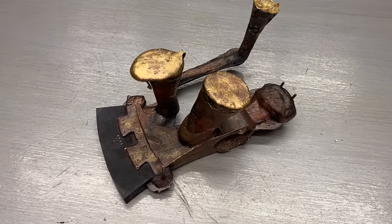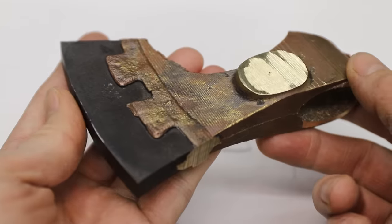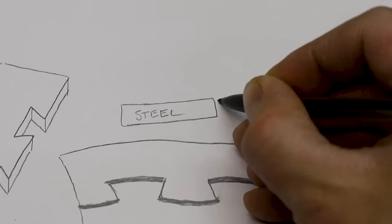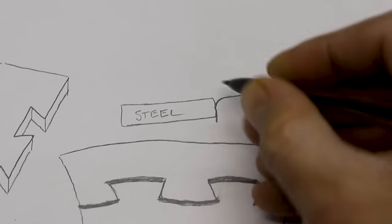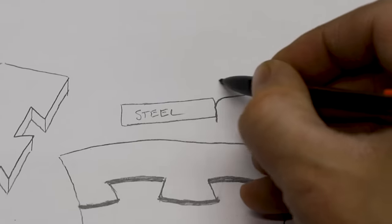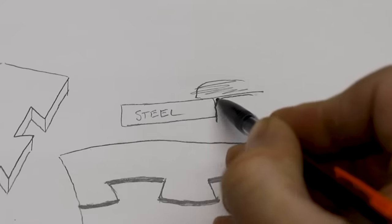Well so far this thing is looking really good, but I won't be sure until I start grinding it. I made the mold so that the bronze actually flows up and over the steel. The reason I did that is because I didn't want the metal to flow up to the steel and leave a little gap — instead it'll go up and over and then I can grind this away and be left with a nice flush edge.